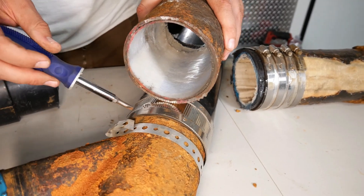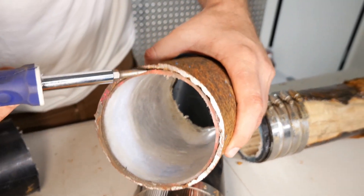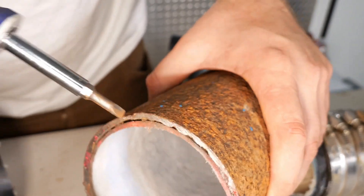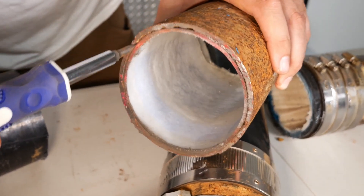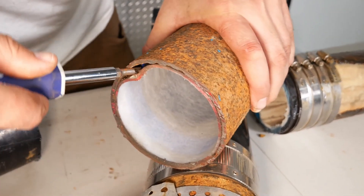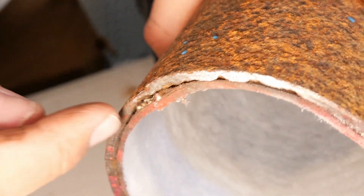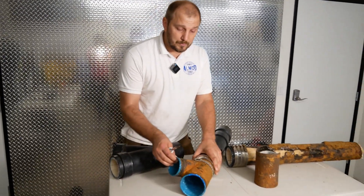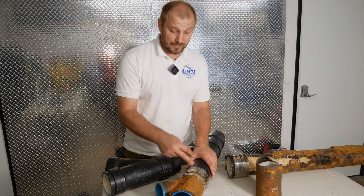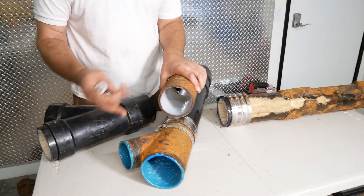With a cast iron pipe, when you run a pull-in-place liner and stop just before the branch — they always leave two or three inches — you can see there's a gap between the liner and the pipe. When the pipe has a crack, water travels in that gap between the liner and the pipe wall. When roots go in, they easily break the pipe, shift the liner, and break it. There's nothing you can do because you have a source of water coming in and breaking the pipe. But with spray and brush coating, the entire pipe and all branches are 100% lined — no free spot.